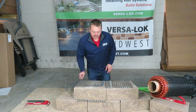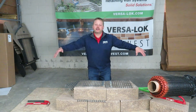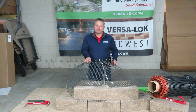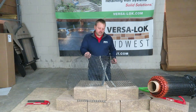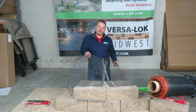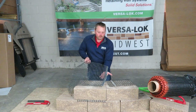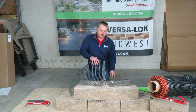Sometimes it's unavoidable that you might need to overlap your GeoGrid — maybe that's spec because it's an outside curve. As this grid goes back, it's going to overlap at some point. A way to undo this is by slightly deflecting either the left side or right side up or down from each other so there's at least three inches of soil in between. That's going to make sure you don't have an overlapping slippery grid and that it's a stable soil condition.